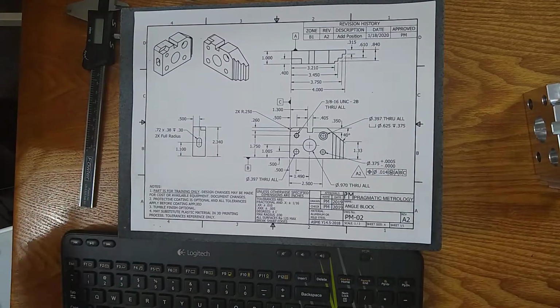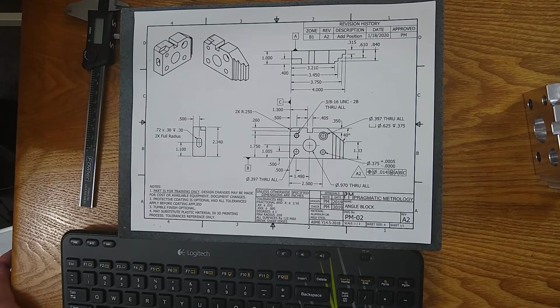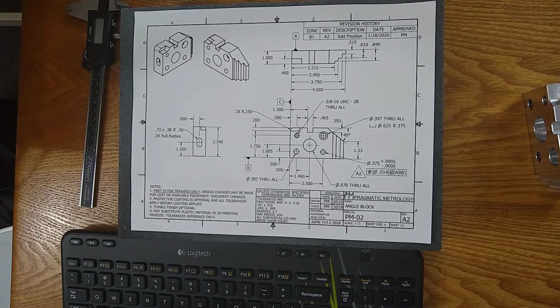And then your standard tolerances. So this is important. Really understand your standard tolerances, because wherever you see a dimension, it'll have a decimal point, 3 digits or 2 digits or 1 digit. It might be a fractional call out. A lot of hole depths are called fractionally. So this is telling you what your standard tolerance is.